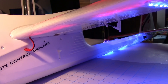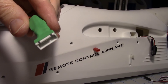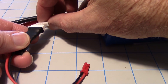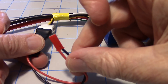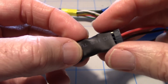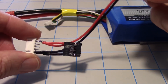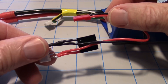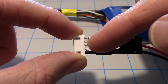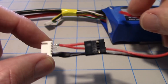It's a four-cell battery so I had to specially order those four-cell balance plugs from Hobby King. It plugs onto the balance port so you can pick off voltage to run the LED lights. I cut away the heat shrink to expose the inside, and I need to move this wire over to the third pin to get 12 volts, because right now it's picking up the full voltage off a four-cell battery, which is too much for the LEDs.